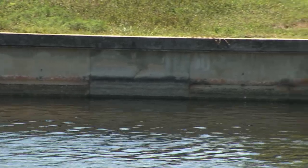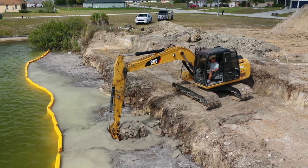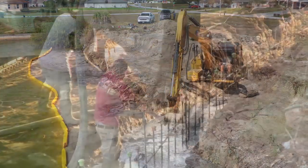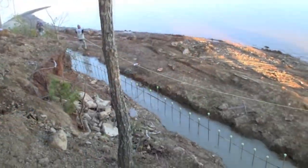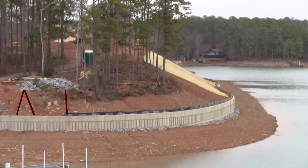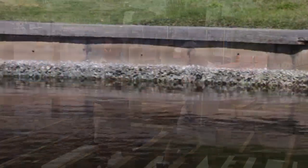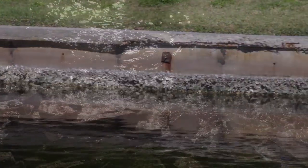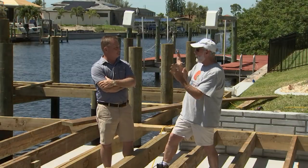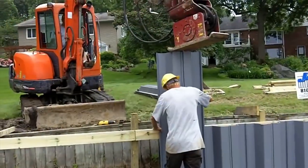You can see the rust coming out from the thing. How a seawall works is they have dead heads — they take an excavator and literally scoop out a big chunk, maybe about ten or twelve feet back behind the bulkhead, pour in a big ball of concrete, and then run thick rebar into the bulkhead to keep it in place. When that rebar rusts through, the concrete seawall literally crumbles and falls into the waterway. Huge expense removing it.